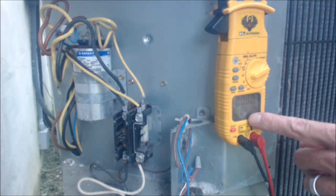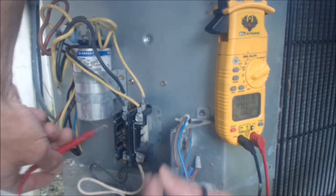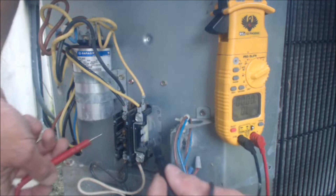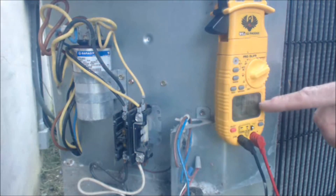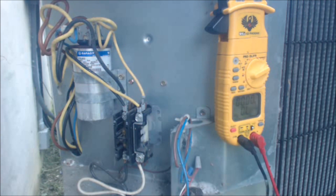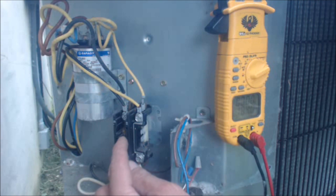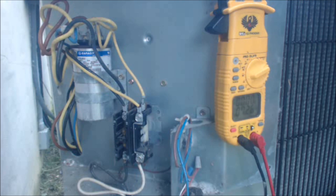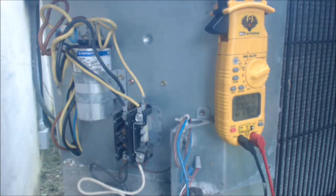If we had OL — just like we have right now when we read resistance of the 24-volt coil, not the 240-volt lines but the 24-volt coil — if we read that and got OL, then that means that coil right down here is actually burnt apart. It's an electrical solenoid that just sucks this contact in, just like this. Once again, the power is off right now, so I'm just showing you the plunging action.